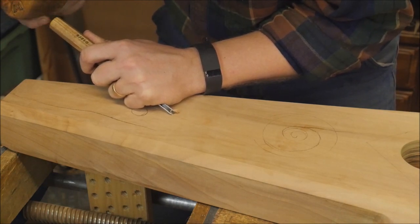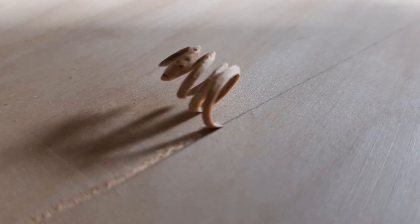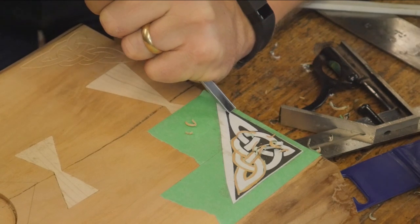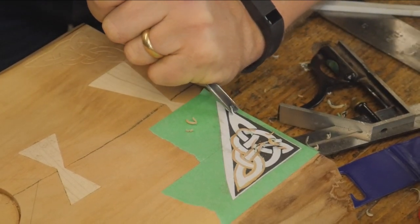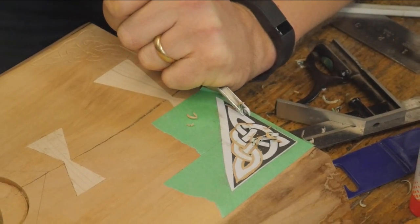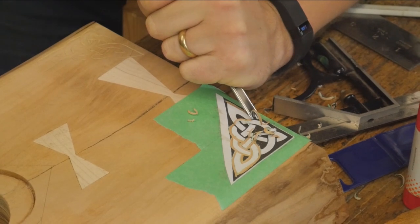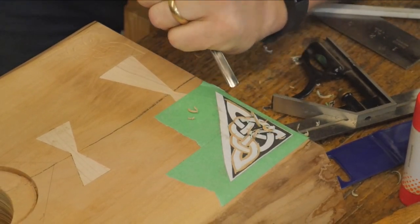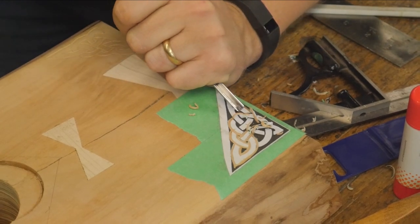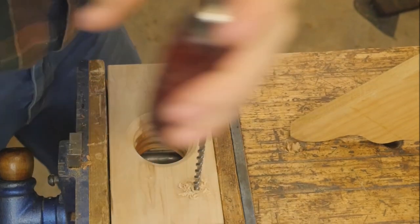Next up — carving. This is a beautiful piece and I need to do some carving. I'm just using a V-gouge to make this track, and cherry is such a joy to carve — so much easier than white oak. I did a little spiral pattern at the bottom and then Celtic corners, which I figured would match nicely with the bow ties and live edge and just give it a good feel all around. This is actually a very simple skill to learn, and in a matter of five to fifteen minutes with a V-gouge and a nice mallet you can learn to do this yourself.